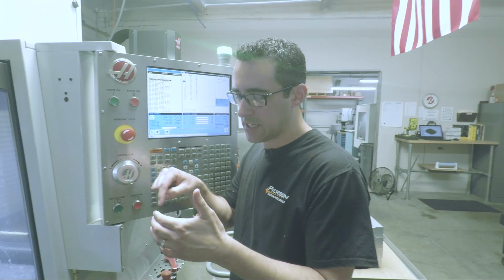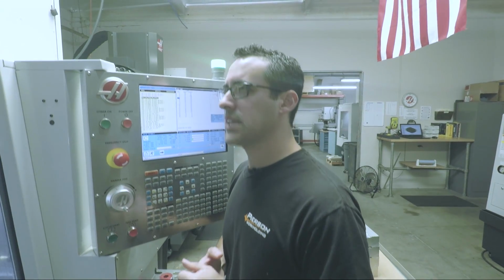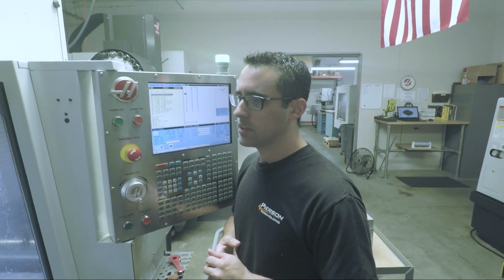And then with a really, I think it's a 1/16 diameter, we go in and kick out the corners. In the corners of the diamond pin, we just need to carve out the little corners. It's like finishing. What is that term? Rest machining, yeah.